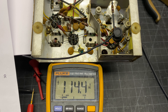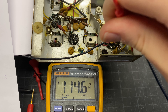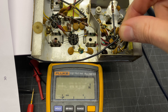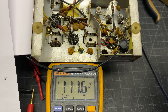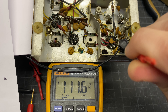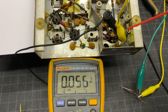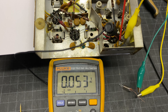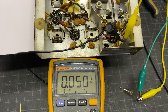I don't think that corresponded with me making that tuning adjustment — I think it was just coincidence. Let me tap on some connections here and see if we can get this to come back. Checking the voltage on the other side of this resistor — the voltage is there and it's above 107 volts. I'm guessing that this lamp is just intermittent. So what I'm going to do is clip a different lamp in and see if it stays steady.